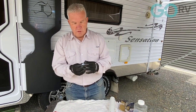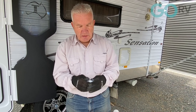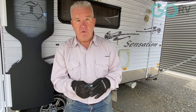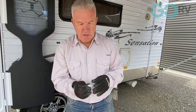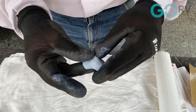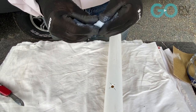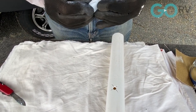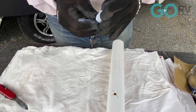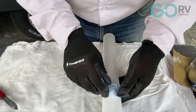I think we've just about got it all together - it's now one colour, a light bluey-grey. You've got about 20 minutes at this stage because it's starting to cure, and in 20 minutes time it will have gone off, so you need to move really quickly. Anyway, that's ready to go - there's the consistency of it, I can still mould it reasonably well. Here's our bit of pipe, so what we now need to do is get that putty into the pipe and get a bit of it into the hole as well. Let's put it on and slowly mould it into shape.